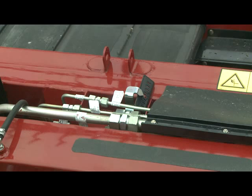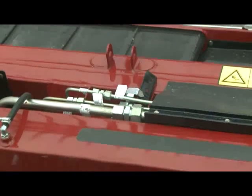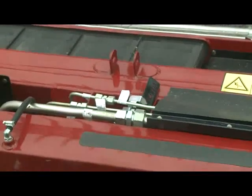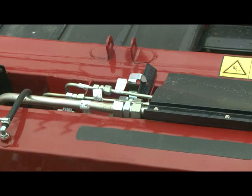One of the first things to set is the knife angle. The knife angle indicator is currently in the middle of travel, which is where we want to start. If it wasn't in the middle of travel, use the shift button and then the reel fore and aft control to adjust it. You can make the knife angle very steep or very shallow. In different ground conditions you might want to rock the head back so the cutter bar floats up and over obstructions, or for low-lodged crops you may want to go beyond center. For the most part, start right in the middle of knife travel — the big circle in the center of the indicator shows you that position.